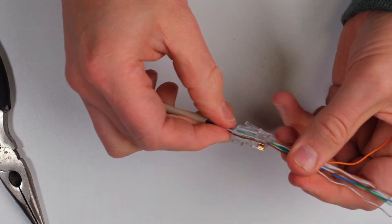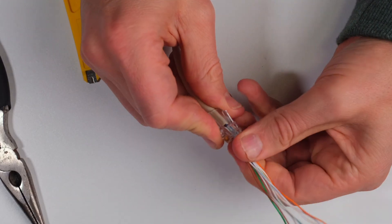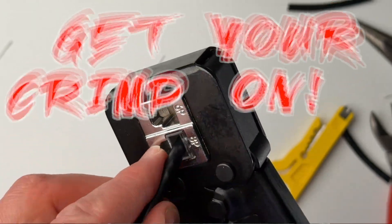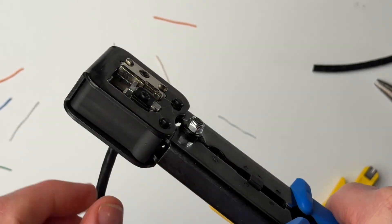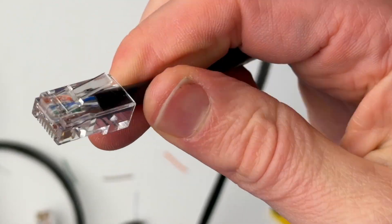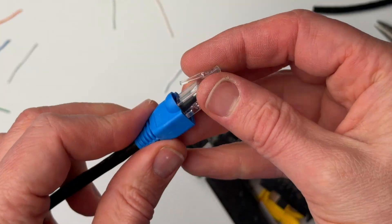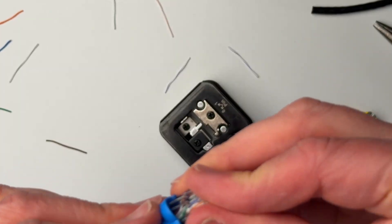However you get the wires into their respective holes, once they're all in properly, pull the wires through until the twists are in the base of the connector. Then insert the connector into your crimper. Squeeze hard on the crimper — this feat of strength pushes the gold contacts into the wires and cuts off the excess wires sticking through the connector, leaving a nice, clean, beautifully crimped RJ45 connector that you can show off to all your friends. And that's pretty much it. Now you can slide the relief boot into place and then do the same process again on the other side of the cable.